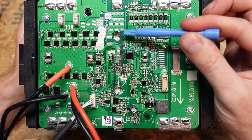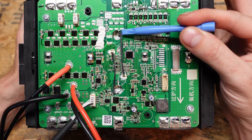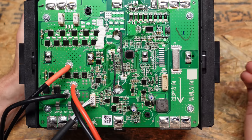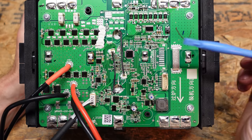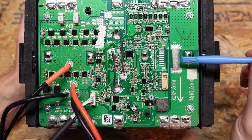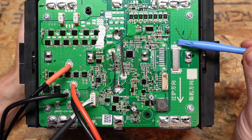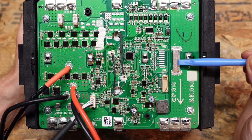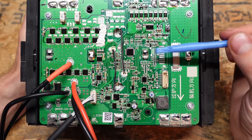Additionally there are two temperature sensors on this battery — one located here and a second up at the top. I do not see any shunts or anything to measure current flow. There is something labeled JP1, which usually means jumper, so I don't believe this is a shunt. Other than that I assume this is mostly the computer circuitry.